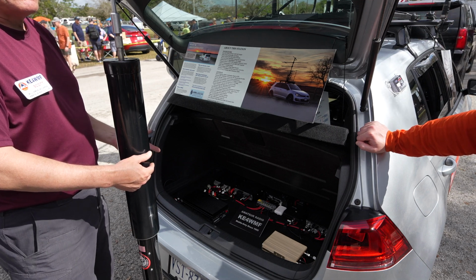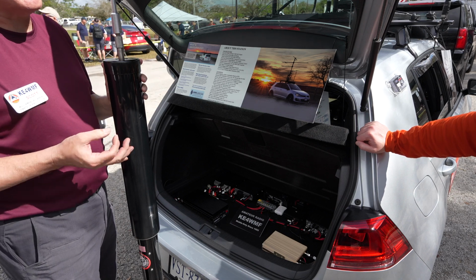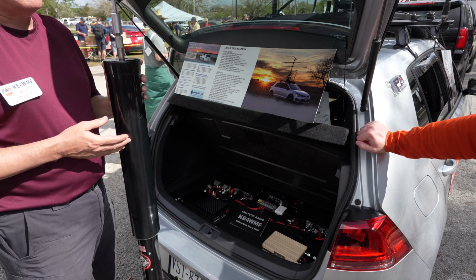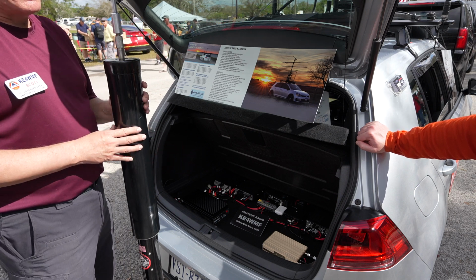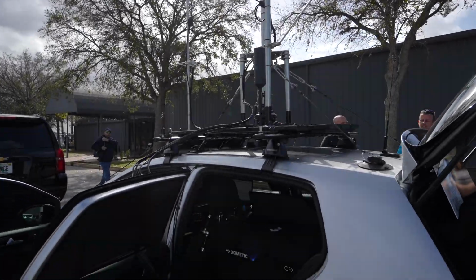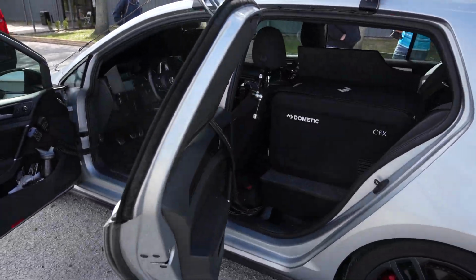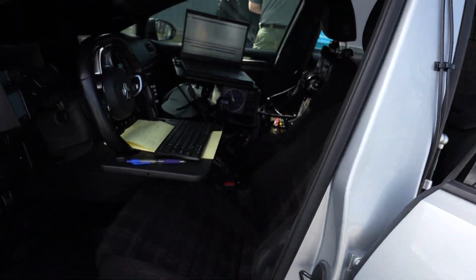Why? What is it about the 857 that you need? It does UHF and VHF single sideband. Oh, single sideband. So I use it only for VHF and UHF. Got it. And then the HF output will eventually be used for a 222 transverter or other transverters if I decide to go further. Okay, I got it now. That makes perfect sense. Then I've got a GMRS radio there.